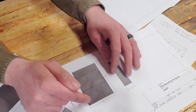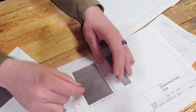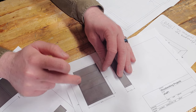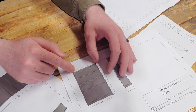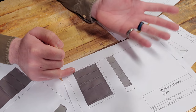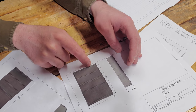Then I put a foot-and-a-half space, another rectangle — a foot-and-a-half by three — then my shelf again at three quarters. Then a ten-inch one, then my other rail because that's about the middle shelf. Then another ten-inch rectangle, a three-quarter-inch rectangle, ten-inch rectangle, and at the top a two-inch rail across the top. If you don't do this, it just looks like a box, something you'd buy at any store. It looks cheap to me. I like this top rail — it's not necessarily structurally necessary, but I think it looks better.